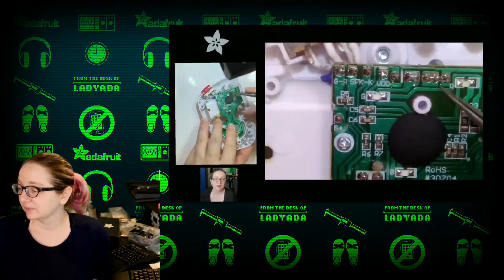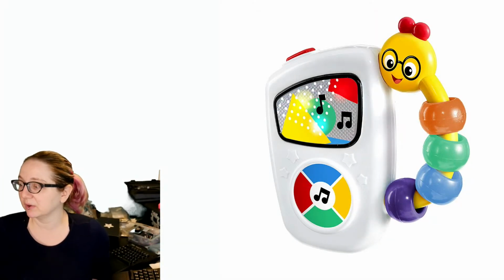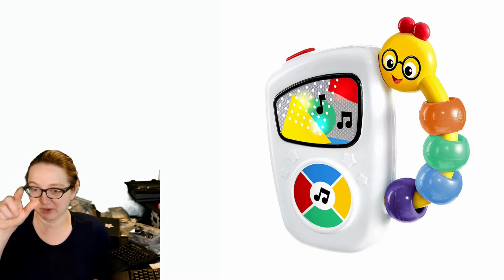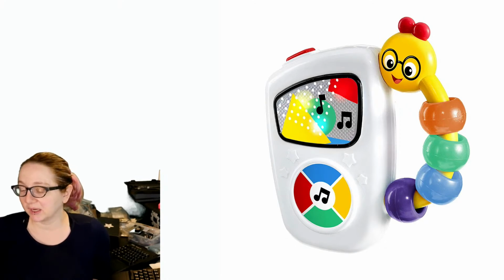And check out our video. We're gonna post these as a series. We just scanned in the PCB. That'll be the next thing later. So the next thing I got is, Phil scanned in the PCB. I'm gonna take the PCB and do a trace. I rasterize it into monochrome, and then I simplify it, import it into Eagle as a background image, and then I trace the design. I've done this before. It's not too bad. You just trace the holes and the slots, and then now that I've got that, I save it into my GitHub repo. We'll make a GitHub repo for all this, of course, and then I can start laying out components.